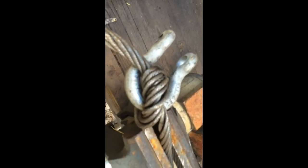I want to show you something — a couple of things here — something never to do. This is a choker cable with double chokers and two sockets. You can see how the ends have swaged fittings on the cable. Some moron thought he'd do it differently — he put a shackle and tied an overhand knot through the shackle with the end of the cable. I'm going to try to fix this cable up. All we're doing with it is dragging some logs, not lifting.